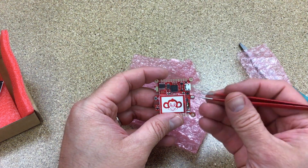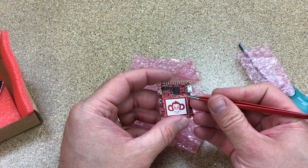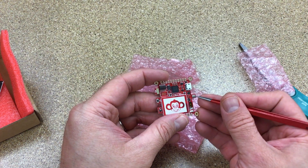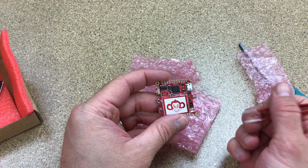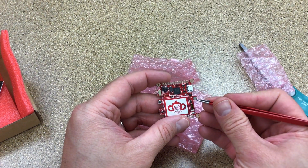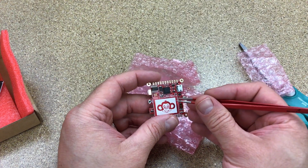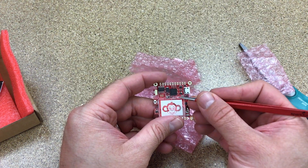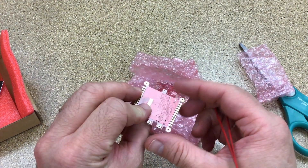PCBNG sent me some pictures of an x-ray inspection of the BGA part as well as the land grid array part — a bottom port I2S digital microphone. Those x-rays looked great and showed no solder bridging of any kind.